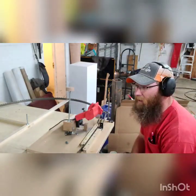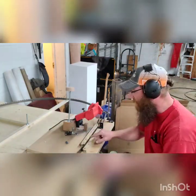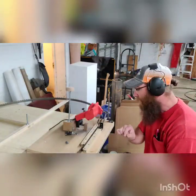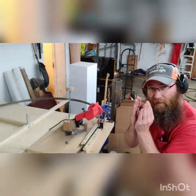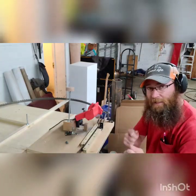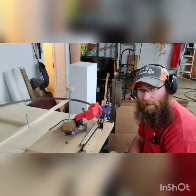That said, a drag grinder or a CBN wheel grinder are going to be better than what this setup is because it'll grind out the gullet. That's important because the gullet develops microfractures in the blade. And if you don't grind those out on each pass, then those microfractures will open up more and more and more, and then your blade breaks. What I was doing was chucking the stone in the angle grinder, cleaning the gullet out, hitting the back of the tooth, and then once that's done, throw it on here, and then grind the face of the tooth.